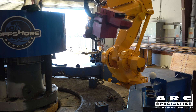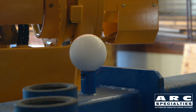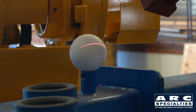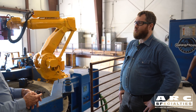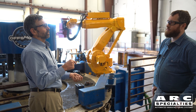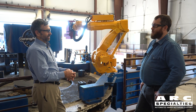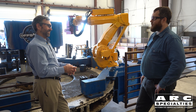So it's a 2D laser line scan. Basically what that gives you is a 2D map — an X and a Y of where the laser sees the reflection. On those six or so scans, you'll get six different spheres or ellipses. As you notice, we didn't actually scan the center diameter every single time — we scanned the edges, the tops, and offset as well. So in all that, the software is able to calculate where is the center of the sphere, and in doing so it calculates where is the tool center point. With one laser beam you only get one data point every time you move the robot. This is 1,024 data points every scan you take — a lot more data.